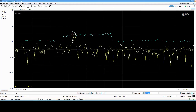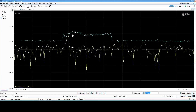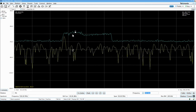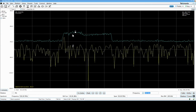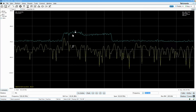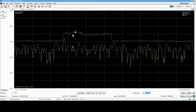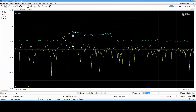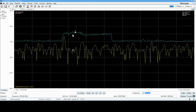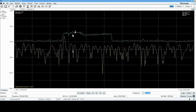We can see there's about a 3 dB gain from the tuning. This is what it's all about in terms of sweeping. I can sweep back again and you can see it has a different shape now. This is a very simple tool to make sure that your antenna is tuned — the sweet spot of your antennas is tuned to the same frequency — and they're not always tuned at the same frequency. This is where the RSA 500 really can come in to help you looking at the signal.